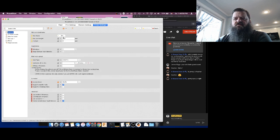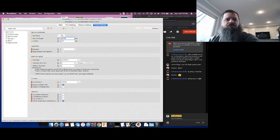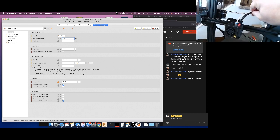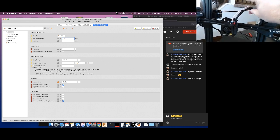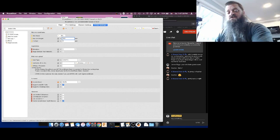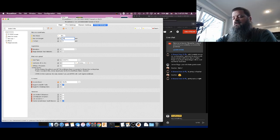Back in printer settings, there are a few more things we need to do to the Ender-3 Pro. Go through all the tabs and look for anything that looks out of place. For example, the max print height — that Z height we initially weren't able to put in. We want to set that to 250 because that's how high it said it could go. But I'm going to leave a little bit of slack and set it to 240, since I don't plan to print over 240 millimeters. Feel free to set it to 250 if you want.